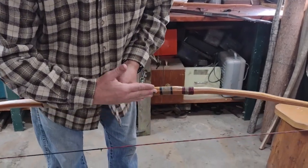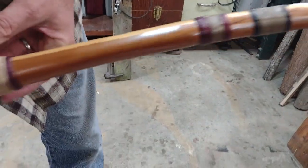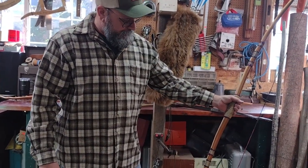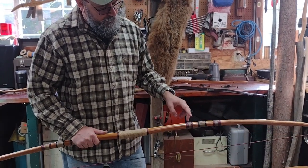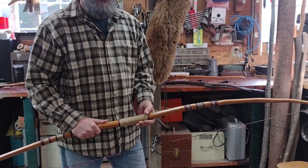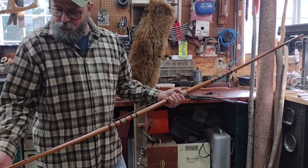As an experiment, just for the fun of it, I took another piece of yew, ground all the way down to where that wind shake split was, and glued in another piece of yew wood right there. Then I re-tillered the bow, finished it, and I've been shooting it. The old-timers called a wood plug like this a Dutchman — they'd use them through knot holes or on the belly if there was a problem there. This bow is also rawhide backed.